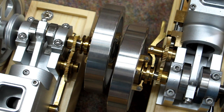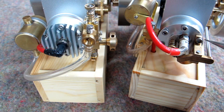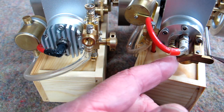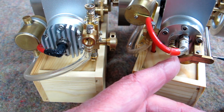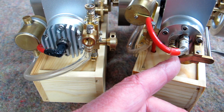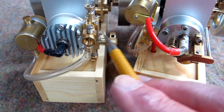All of the ET1's complexity has been eliminated and replaced by this single rocker arm. On the ET1, if you take out the two head bolts and the support for the rocker arm, there are no indexing or alignment pins, so that thing is free to move. When you go to put it back, trying to get it aligned so it hits the top of the exhaust valve correctly when you tighten it up is a little tedious. It's not a big deal, but for someone who hasn't worked on model engines much, it can be a problem. So this makes life simpler.